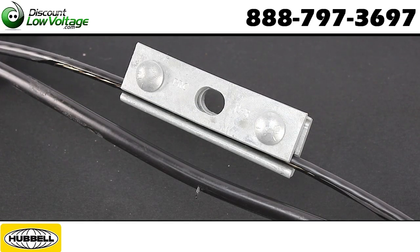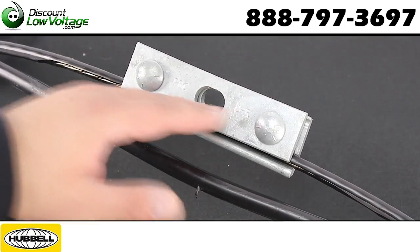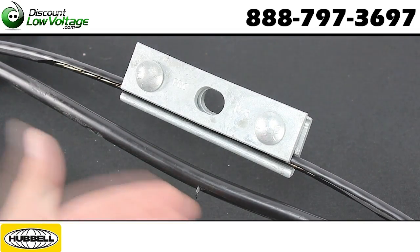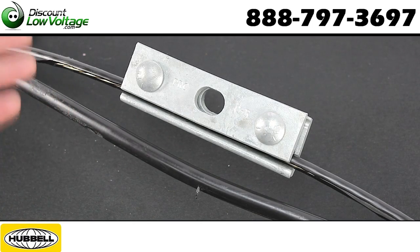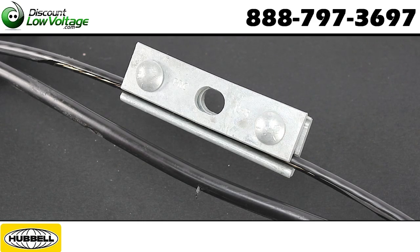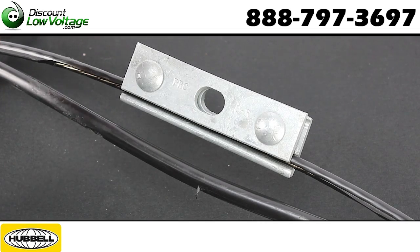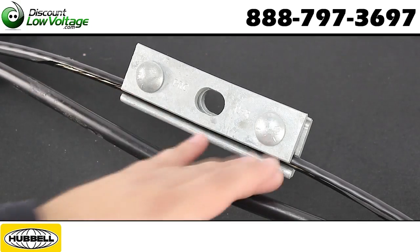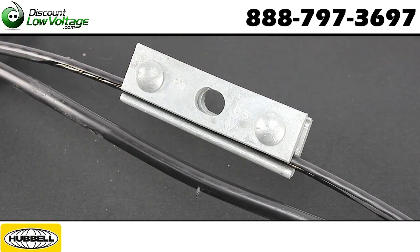This is an example of the same piece of hardware using the bottom slot made for seven sixteenths. If you're using a figure eight cable — this is a 25-pair figure eight by General Cable — you're probably going to run into the General Cable brand, as they seem to be the most popular for these applications. Their spec sheet mentions quarter inch messenger wire, but with the coating around the messenger, it's a little bigger, so you'll want to use the bottom slot and add some lock washers behind there.